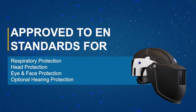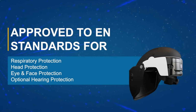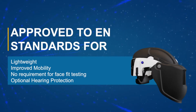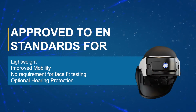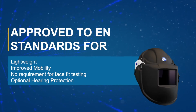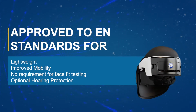The PureFlo 3000 is an all-in-one head-mounted PAPR approved for respiratory use, head, eye and face protection, with optional hearing protection available. The head-mounted design of the PureFlo 3000 means there is no hose or waist-mounted unit. This prevents the risk of snagging and enhances user comfort and mobility in the workplace. The unit does not require face-fit testing prior to use and can be worn with facial hair and/or spectacles.